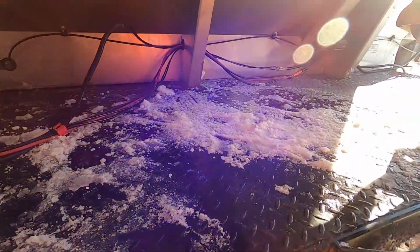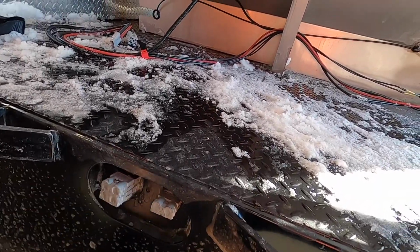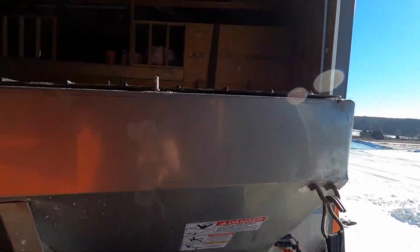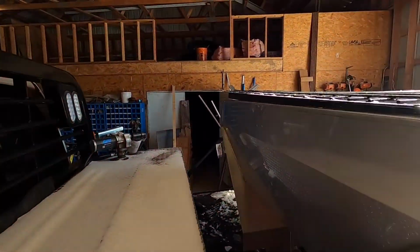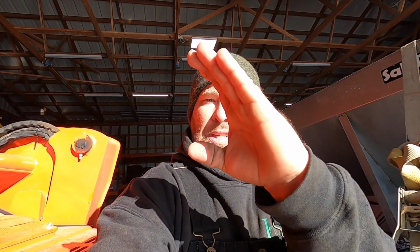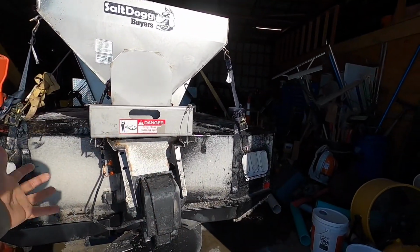It literally slid off. So what I did is I unplugged my plugs and put my total plugs back on to where it kind of closes them off. I threw them up there and strapped it on like I normally would, and then I had to put this on because see, this is in the little pocket, and if you go up here and look, see how that grate's not even sitting into the spreader? It actually racked the spreader. So if the spreader's like this, now the spreader is like that. It's about 2 inches out. Besides this, because this hit the ground, obviously, as it slid off, this hit the ground and wah.